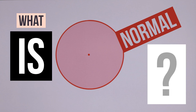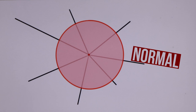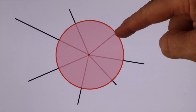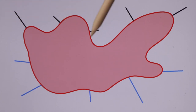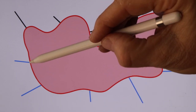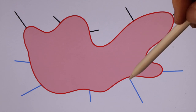One thing to think about when cutting a mold is the angle that you cut into the surface with. The black lines shown here are surface normals — they enter the surface at about 90 degrees, meaning about 90 degrees on either side of the line. The real definition of a normal is that it intersects the circumference of the circle and goes to the center. You want to come in as close to normal, or perpendicular, to the surface as you can be. The black lines here are pretty close to normal — that's how you want to cut. They don't have to be perfect, but they have to be pretty close. Even the blue lines at more of an angle are still acceptable because there's enough material on either side of the cut that the two halves support themselves.